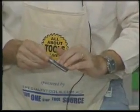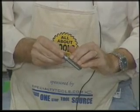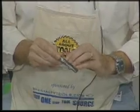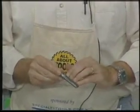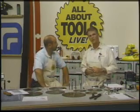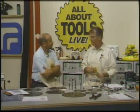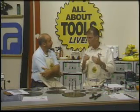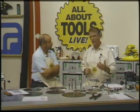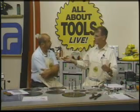Now, I know that Velapac uses a C2, what do they call it? C2 micrograin. Right. Carbide. And what that's like a super sharp. The micrograin makes it super sharp, right? Well, no, the micrograin actually makes it more flexible. It's the way that it's molecularly altered during manufacturing, because carbide is a very hard, rigid material. Yeah. So if you use like a C4 carbide, which would make it very hard, which in turn would make it very brittle, much like in the solid surface industry.